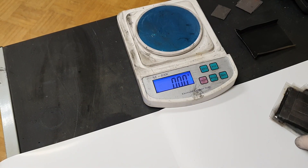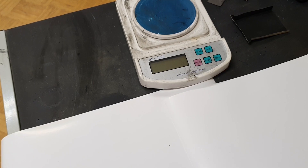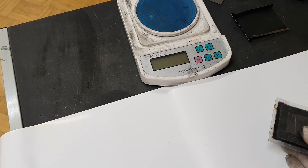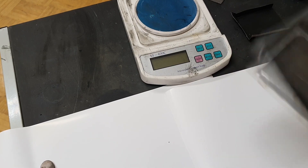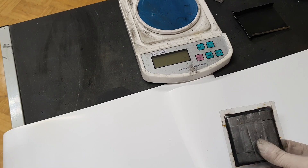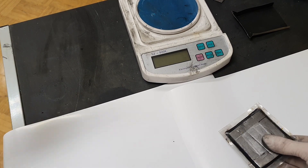This cell is really interesting because it has a really stable discharge curve. Here I have three cells. The voltage of these cells is 1.3 volts because I modified them to get a really stable discharge curve, and that's why I sacrificed some of the voltage. The starting voltage was about 1.7 volts, but after modification it is now 1.3 volts with a really stable discharge curve.